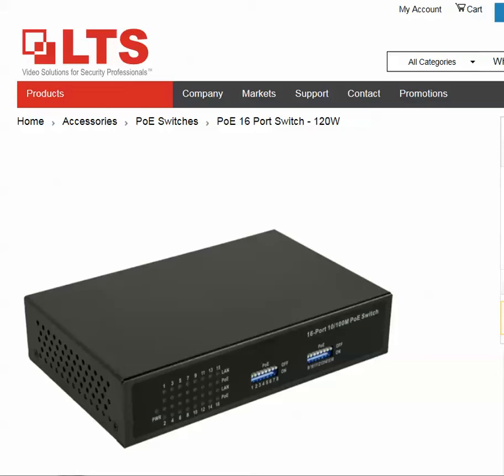In this video I'm going to discuss PoE switches and how they are changing to better accommodate installers for longer distances. Your typical PoE switch has a 100 meter limitation, which is approximately 328 feet. When you need to go longer than that, you either have to use a PoE extender or some other in-between switch to transmit another 100 meters.